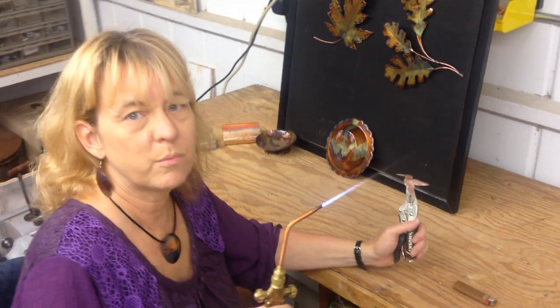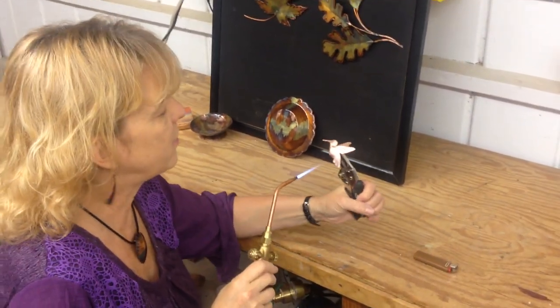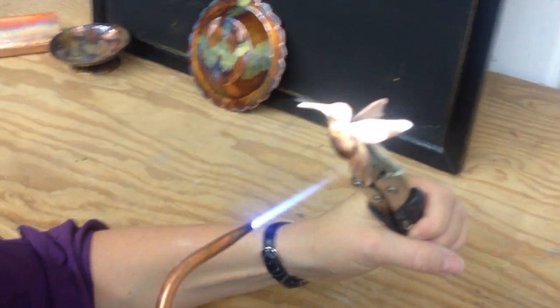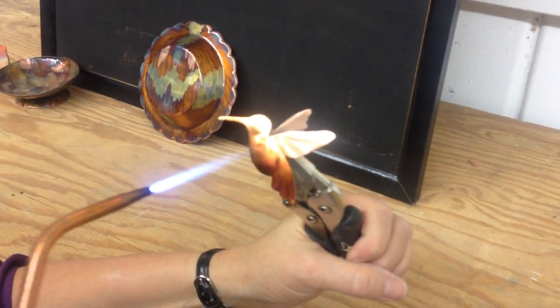What I'm going to do is start off with a propane flame, and as I heat the copper you'll see it turn pretty colors. The colors always happen in the same order, and understanding that order allows me to choose my colors for my final flame painting.